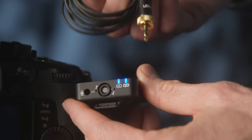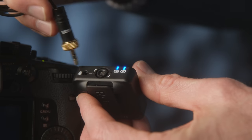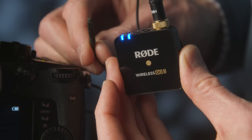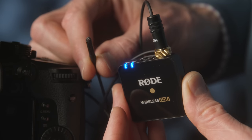If you're not into using the inbuilt microphone, you can also plug in an external lavalier or other microphones, such as camera-top shotgun microphones. It has a 3.5 mm TRS input and supplies four volts of plug-in power — which most lavaliers need.